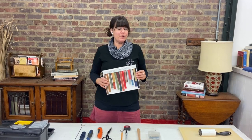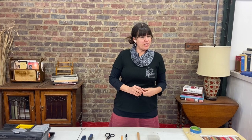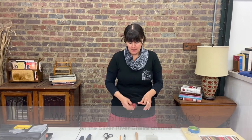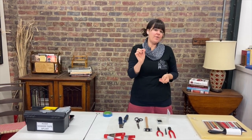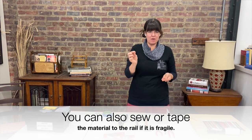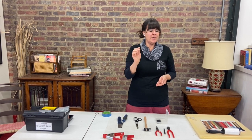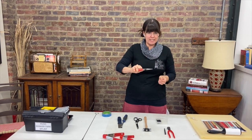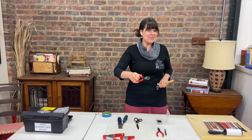Let's talk shaker tape. Shaker tape comes in a variety of colors and sizes, so check with your supplier to figure out how much you'll need for your particular chair. You need to measure your chair seat — we'll show you how to do that in our shaker tape video, but you'll need some sort of ruler or measuring tape. You will also need a little bit of foam to stuff the seats. Usually with shaker tape, we start with a tack. If you have a pneumatic stapler and air compressor, this is going to save you a lot of trouble because the tacks are kind of fumbly. The tacks are a number three steel cut tack or an upholstery tack — don't use aluminum, they will bend very quickly. These may bend too, so just be patient. You might need needle nose pliers to hold it steady while you hammer. If the tacks do bend, these wire snips are pretty helpful in pulling them out so you can re-tack.